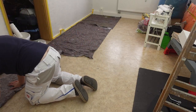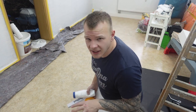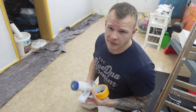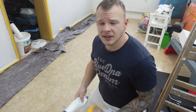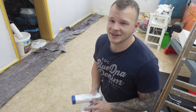So, the Haftgrund is now on and must dry. In the meantime, we prepare our workspace. If you don't have a Kleister machine or a wallpaper table, I can recommend using masking tape and a folding rule: measure the surface you need, add about five centimeters extra, cover it, and tape it all around – then you have your own improvised wallpaper table.